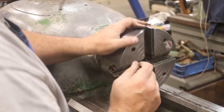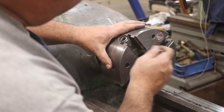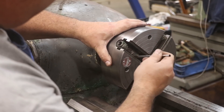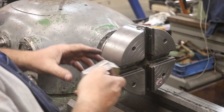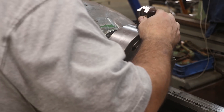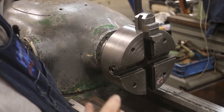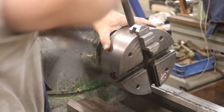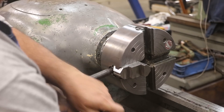When it comes to grease on these chucks, I like to have a little bit, but I don't want to overdo it because if you get too much in there, the metal shavings and so forth will actually stick to that grease and just collect stuff in there, which can cause it to wear. But a little bit is important. I'm also just going to put a little dab on the screws. Now, unlike a three-jaw chuck, these are not numbered in a way that corresponds to the chuck, so we're just going to put them in. It really doesn't matter that much. I did take these over to the grinder with the scotch brite wheel and just polished them a little bit — made sure we got all the rust and everything off of them.